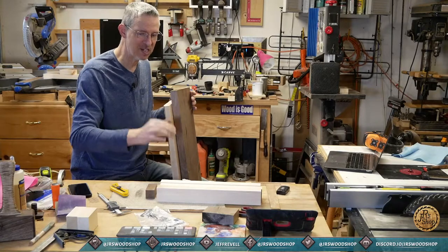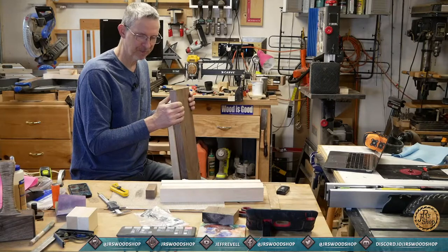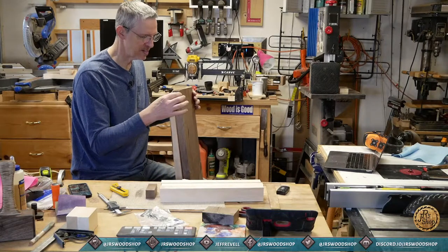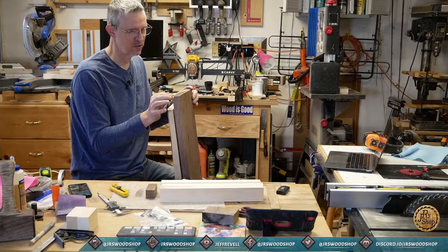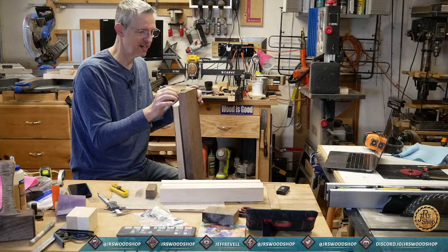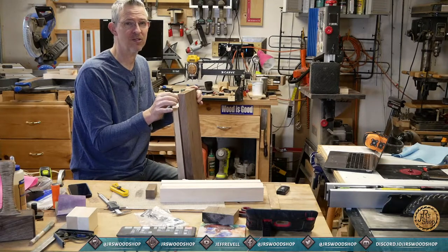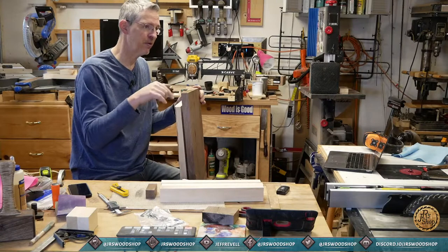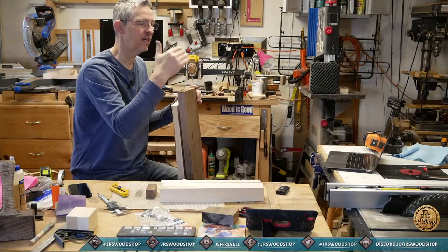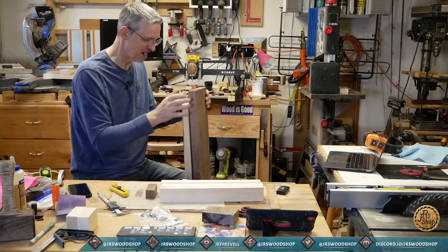It doesn't have to be as large as the cutting board, but it does need to fit, and it doesn't need to be as thick either. Like I could cut these, instead of 1¼ inches, which is what I cut the thickness of those, I could cut the final pieces to, like, I don't know, 3/4 of an inch or 1 inch, do the carving down in there and then separate the carving out on the bandsaw so that it would fall out. The piece that would go inside. So anyway,